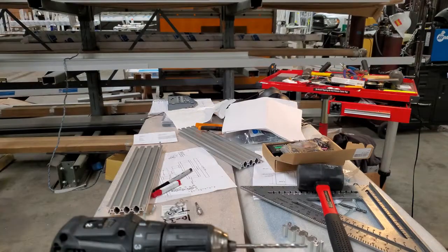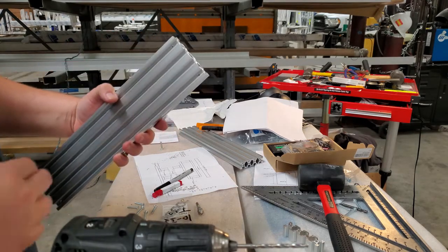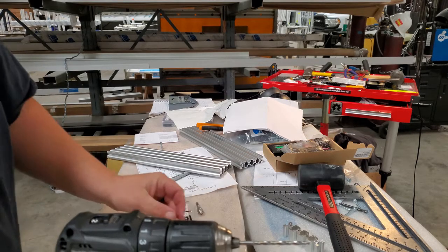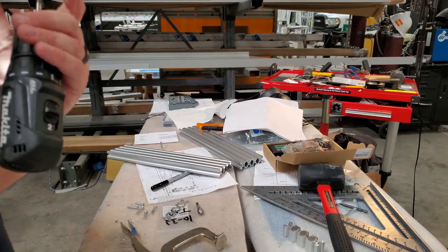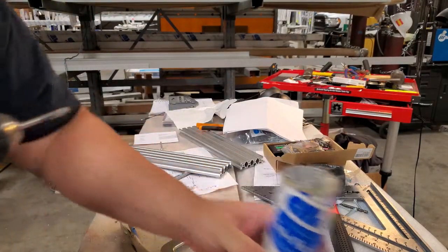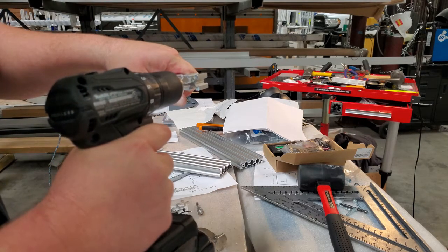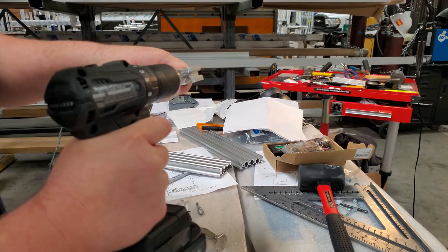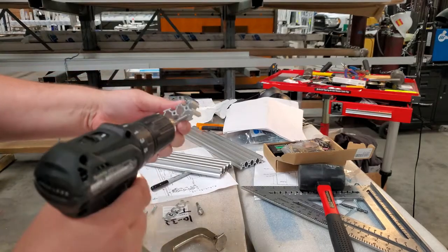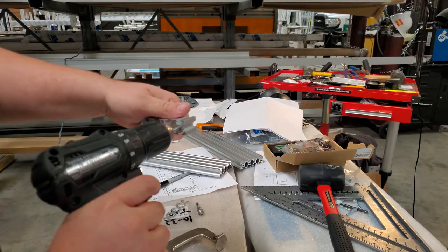That's one real good way of doing V-slot. Now I'm going to move on to finishing my other two holes. When I put that clamp on, I wasn't going to be able to get to those two. So what I'm going to do is I just cut this one-inch piece fresh. I'm going to go ahead and change out my 10-32 tap, get that in there tight. Don't want to do it too fast — get some cutting wax. Now I'm going to go ahead and tap where those two holes were. Real quick and easy — I didn't do any pilot drilling for that.